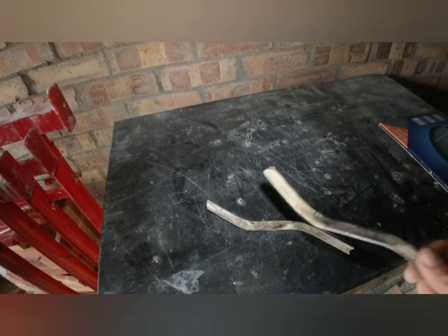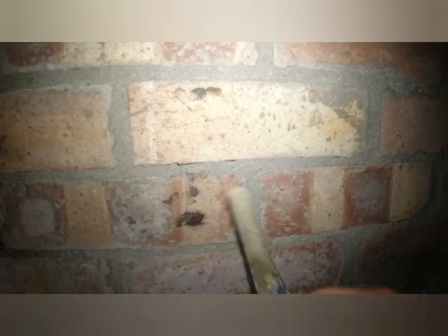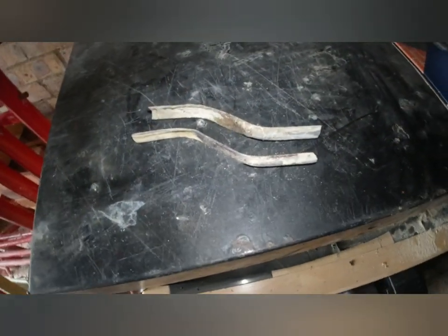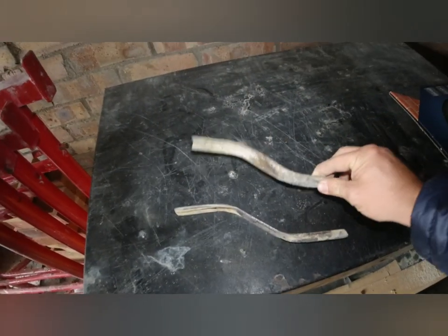Once you've done your work and built your brickwork up level, you're gonna need a jointer to joint your brickwork. It's all well and good having it all built up, but you need something to finish your joints with. You've got a thicker one to use on blockwork when the perps or bed joints are thicker, or for whatever reason the joint's bigger — use the bigger jointer. So there's a bigger jointer, a smaller narrower one, and a neater one for blockwork on the inside.